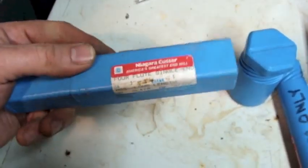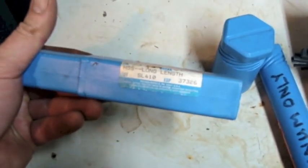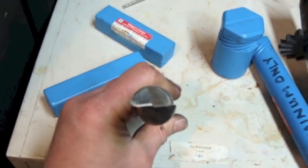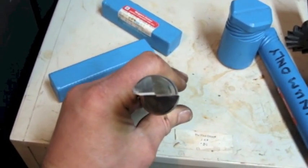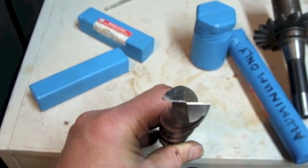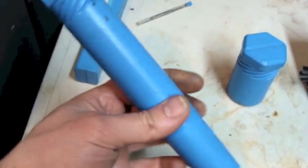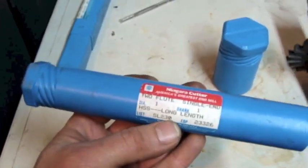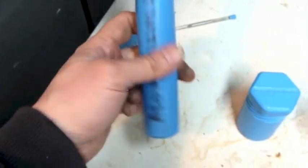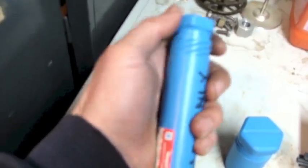What do we got here? Four flutes, single end, one inch shank, long length, high speed steel. It's a big one. This is a high speed steel, so I'm assuming you can re-grind these. Now this big one, the operator put 'aluminum only' - so I guess he didn't want anybody just grabbing this and doing any old thing with it. It's a two-flute, single-ended, one-inch shank. That interesting container - you're gonna have to unthread it all the way to get it out.